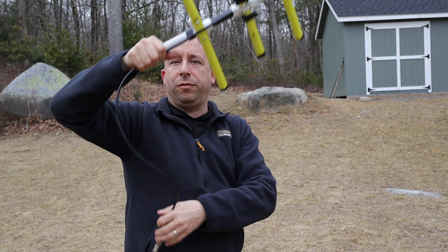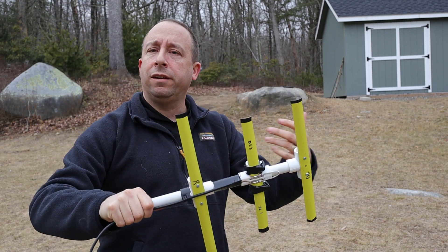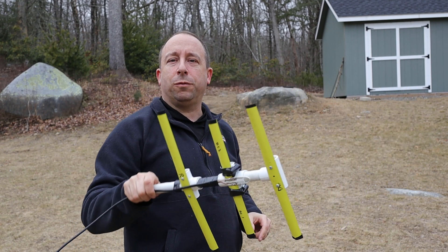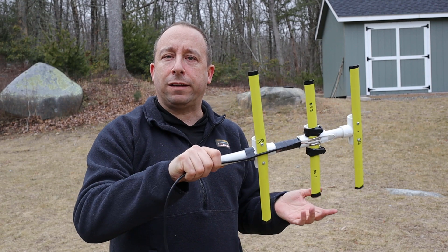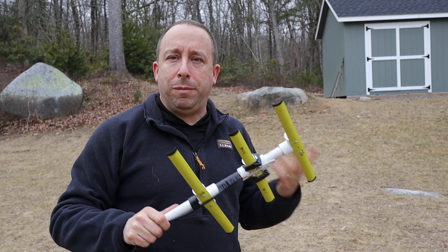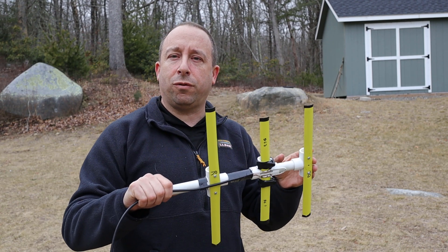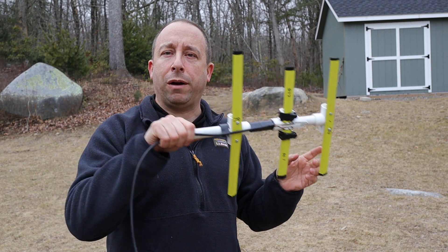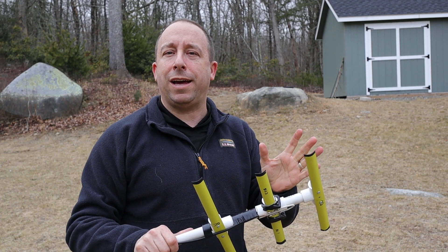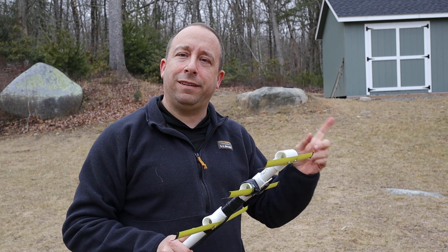The antenna is intended to be used handheld so Bill has added a length so you can hold the antenna and the coax, and connect up to a radio in your pocket or other hand so you can see the signal meter and determine where the signal is strongest. This can be used directly on the 70 centimeter band to look for a transmitter, or to search for a fox transmitting on two meters by receiving its third harmonic. We'll talk more about that in another video.